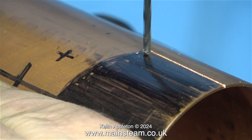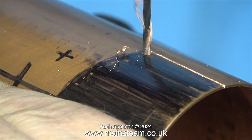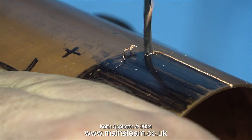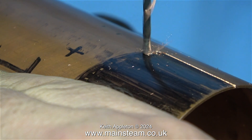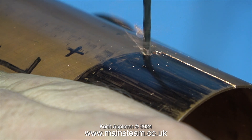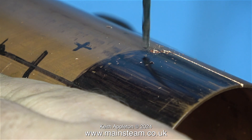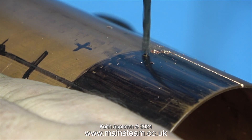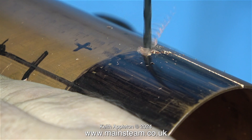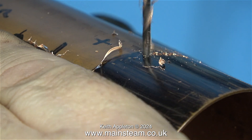For the curved part at the top I decided to use this well-tried and very simple method. I'm using a small twist drill and I'm going to drill quite a lot of holes. Eventually I will join up the holes using a circular cutter and break out the part. If you use a very small twist drill, once you've drilled all the holes and broken out the part you don't want, the jagged edges are easy to trim. If you think about that logic you'll see what I mean.